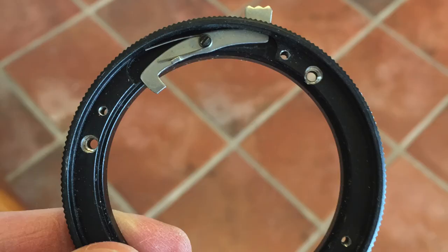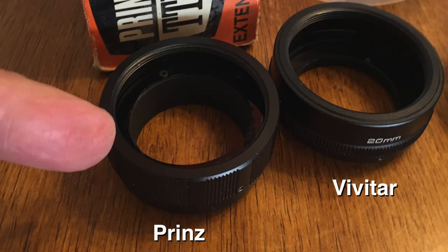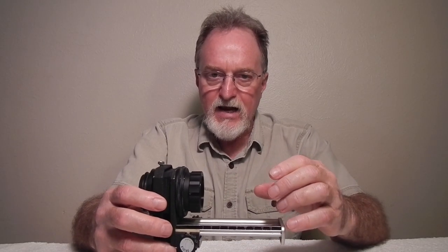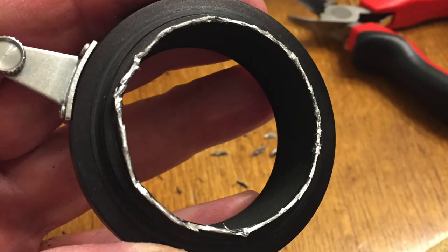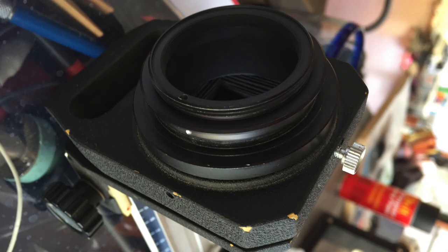The first thing was to take it apart and see what I'm working with. I have a few M42 extension tubes for use for parts and I used bits of both of these. The male side of one was just about right to fit over the rotatable Minolta mount, but I had to take off the bayonet lugs of the Minolta. It was ugly at first, but with some grinding and sanding it fit perfectly. Because the rotation is built into the design for twisting the bayonet on, I was able to glue the parts together and maintain the rotatability.